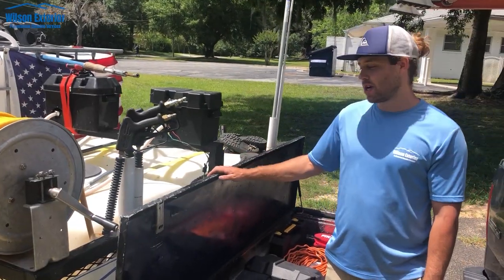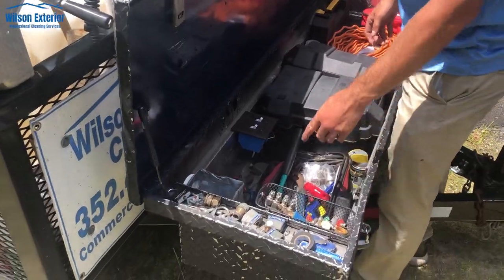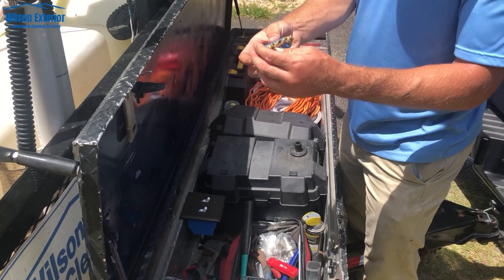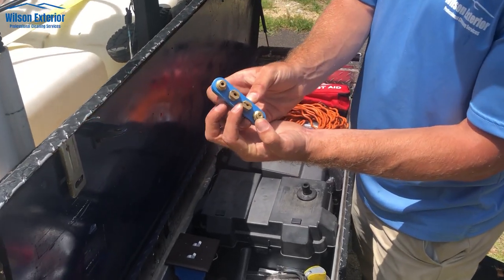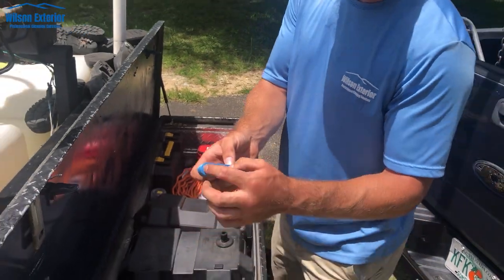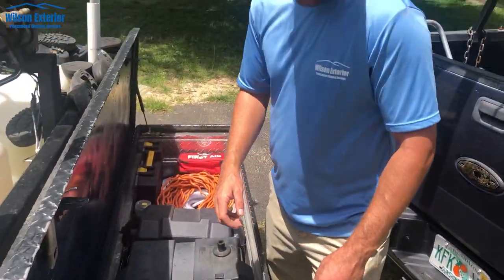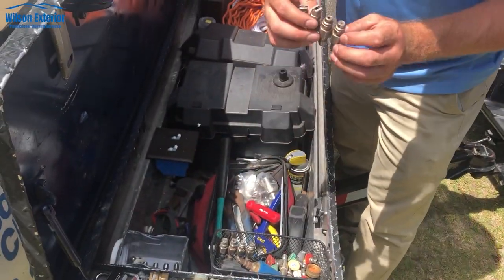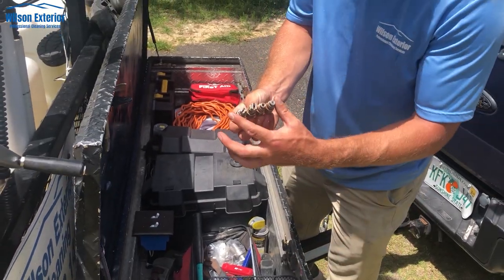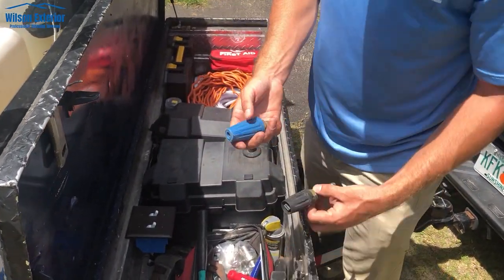This toolbox is the brains of the operation. You've got your 4 gallon per minute tips and your 8 gallon per minute tips. This J-Rod is for the 8 gallon per minute — the two smaller orifices provide fresh water, and the two bigger orifices will pull soap from the chemical injector; keep that in mind when you want to downstream chemical. This is a 4 gallon per minute J-Rod — same story: two bigger orifices pull soap, two smaller orifices pull fresh water.